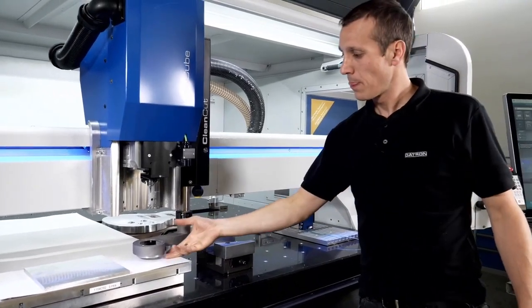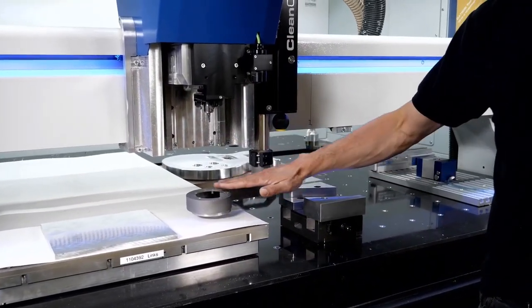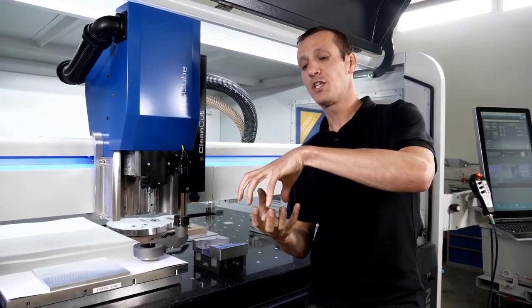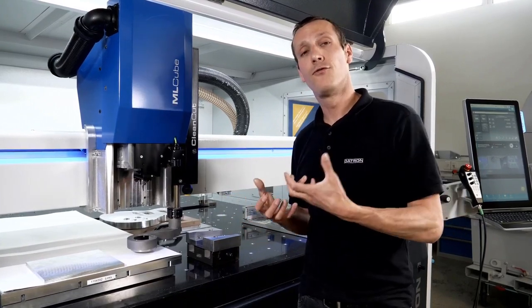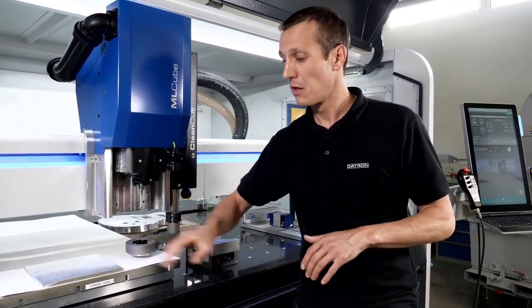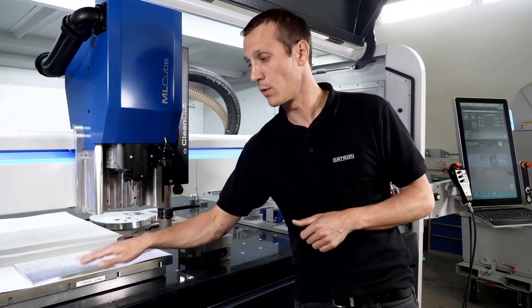The clean cut is a static system. Before starting work, I check the thickness of my plate and adjust the height using the knob on the side with the yellow cap. For plate materials and aggressive material cutting this is extremely helpful, though the deeper you go — such as pockets of around 20 millimeters — the less suction power the system has, as airflow decreases with depth. For thin materials it is absolutely a great add-on.